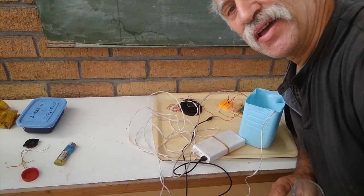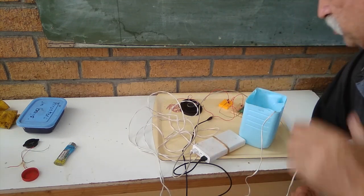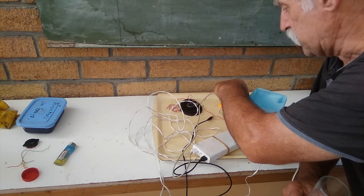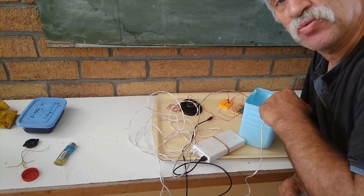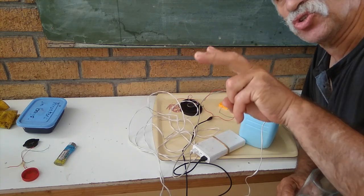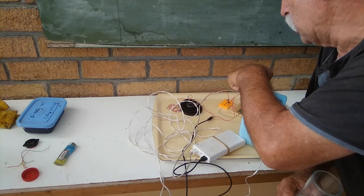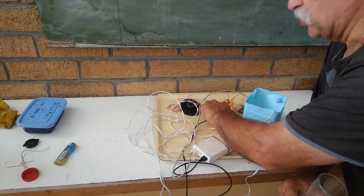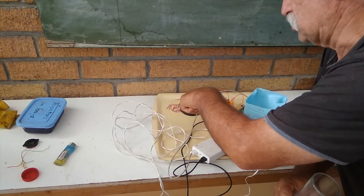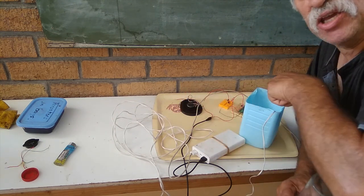Hello all. Yesterday I made a rain detector circuit. It's got a funnel here — when the rain falls in here, there's a Pi Pico that detects the rain. There's a rain switch, just two leads, and when water falls on the two leads it closes the circuit and sets off the Pico. Then we built a little audio amplifier — we took a headphone speaker and there's lots of wire so that we can put our rain gauge out in the rain.